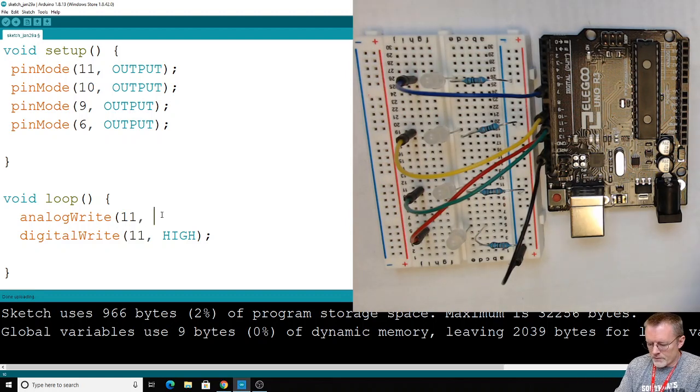So let's make this first one as bright as we can, and we'll make that 255. You might be asking, why 255? Why is this number not 47 or 12,000, whatever? Why 255? Because that is 8 bits. I'm not going to go over bits right now, but you can look that up. Technically, it's 256 for 8 bits if we're counting zeros and ones, but we include the 0, so we are at 255. If you want to, pause and look up 8 bits. Okay, so let's get rid of this one. So this function accepts an 8-bit parameter.